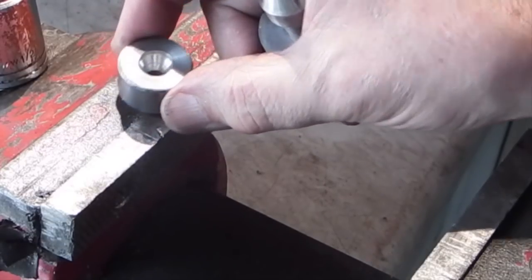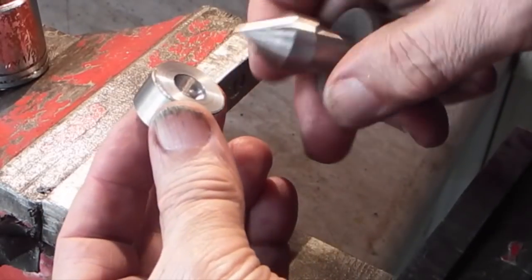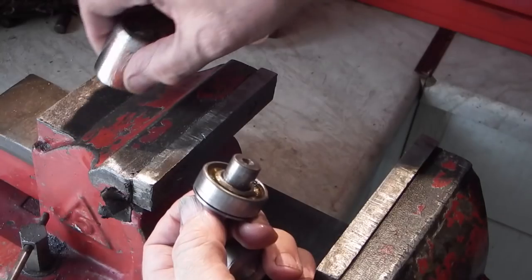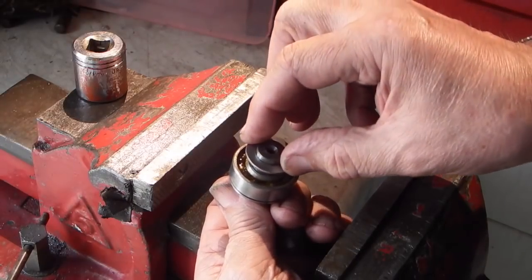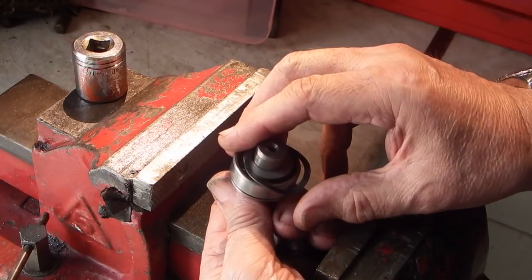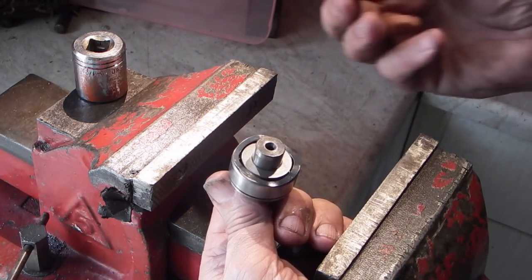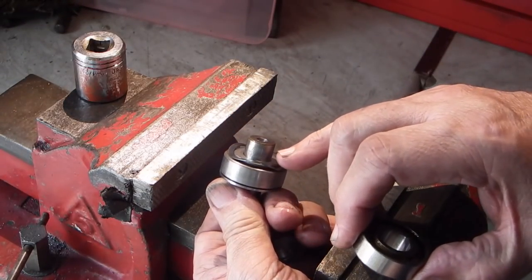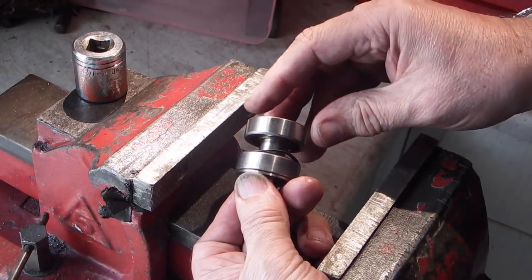To assemble the bearings, I've made a bush with a centre drill so that doesn't damage this. That goes on there and can go into the vise. I'll show you the second bearing now - how to put that on. I'll put a spacer on, washer, wobbly washer, wavy washer, and this bearing which has no seal on at all. On the beginning of the shaft there is a lead so the bearing can go onto the shaft.